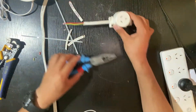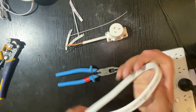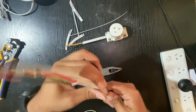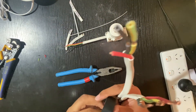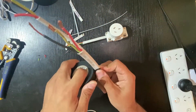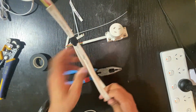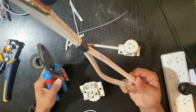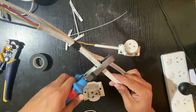I've got another example for you. Whenever you have a downlight, you've got a loop between your downlights. You always use tape when you're looping your cable between downlights, so use tape like this. Then strip your cable first — this is a 2.5 — so I'll show you with the 2.5. Strip it off, just this much should be enough.